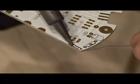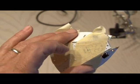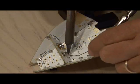And then we're going to tin all the connections that actually put the board together. Be careful doing this and make sure it's lined up properly. It's recommended to use masking tape to hold everything together until all the solder joints are lined up.